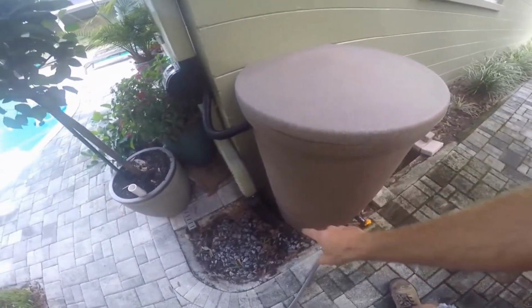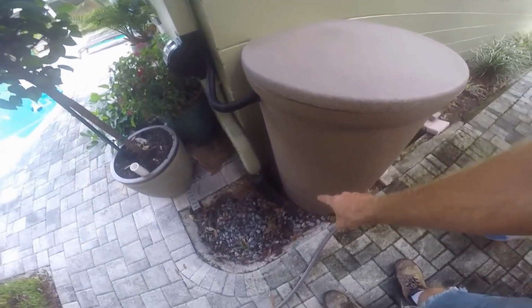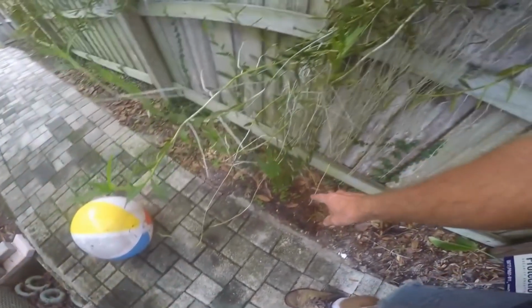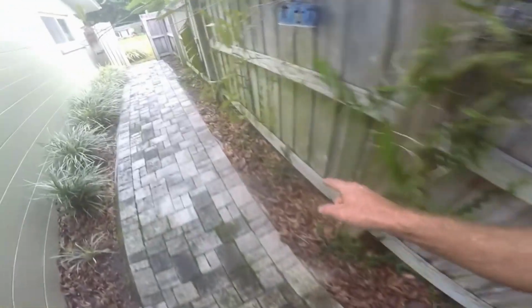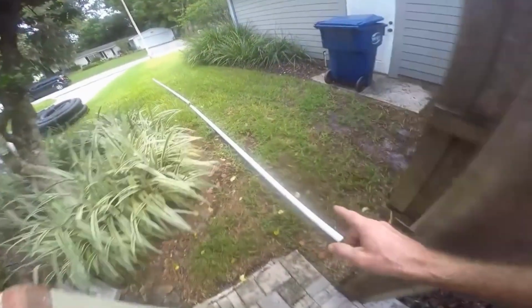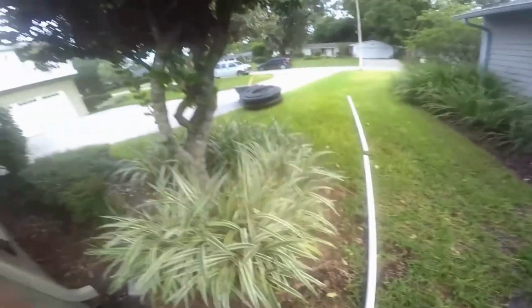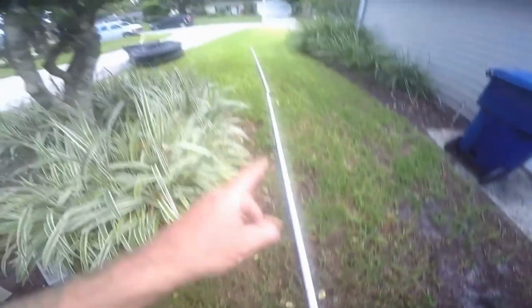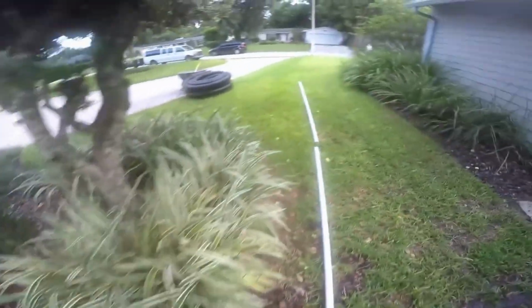We're going to put a sump pit and sump pump right here. The discharge will come across with 1.5" PVC, and it's going to run all the way out between the pavers and the fence. Out here we'll change to 4-inch pipe. See our roll. We'll hook up this downspout, bring this downspout across, and send it all the way out where it's got good discharge. So let's go ahead and get started.